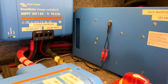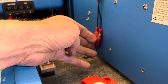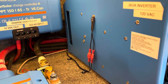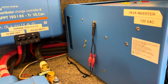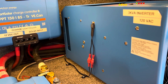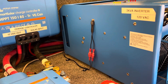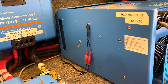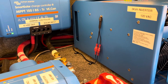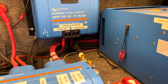I also bought some 40°C switches — that's why you can see where I can disconnect them and swap them out. If the 45°C switch is too high — which is about 113°F — I'm not sure about the hysteresis, so it turns on at 45°C but I don't know where it shuts off. I did notice that the 40°C switch, which is about 104°F, turns on and then shuts off closer to probably 80°F, so that fan may never shut off with that switch.